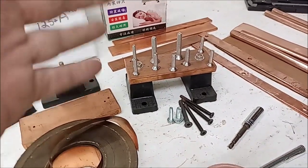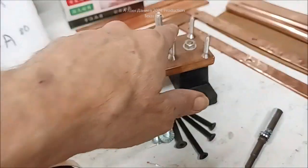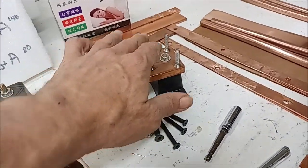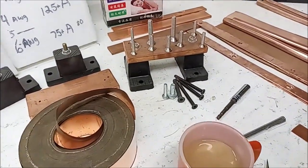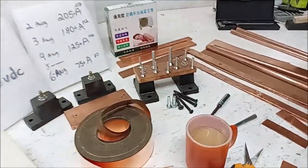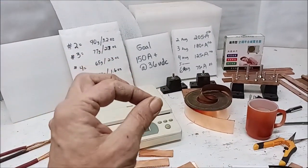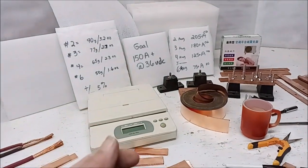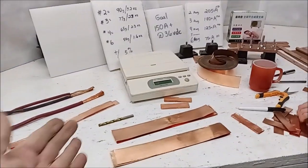It's capable of well in excess of 1,600 amps. We want connection points for solar coming in, lighting and other circuits coming off, and two main inverter outlets. So you connect battery, battery, and battery, with solar here and solar here, and an inverter or two right there - and that's only cost me about $35 to $40 a piece to build including screws. Stay tuned, we've got a lot of stuff on that build.